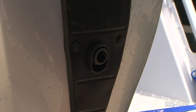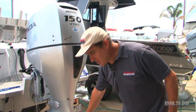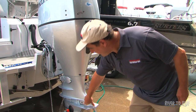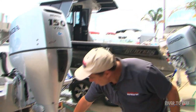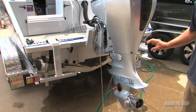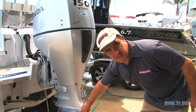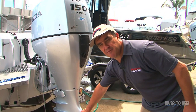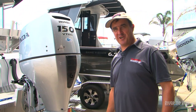Other points of interest we want to have a look at as part of our preventive maintenance are our anodes. Just check those to make sure they're in good condition and not loose or missing. It's usually one either side and one under the power trim and tilt unit. The anode is made of a material that's readily eaten by the salt water — it's called a sacrificial anode. It sacrifices itself to make sure our Honda looks as good as new.